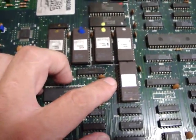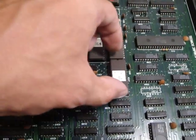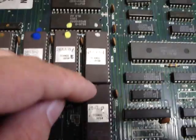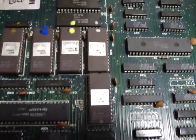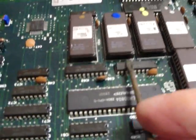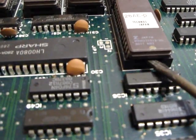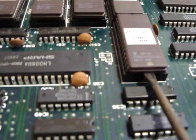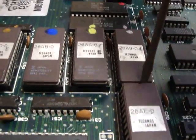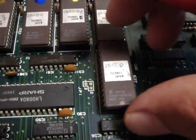What I'm going to show you today is how to remove an EPROM or IC — this basically works for mask ROMs, anything that's socketed — how to clean it up, and how to replace it. There are tweezers you can get that fit around both sides and let you wiggle and pop it out, but on some arcade boards it's really hard to get in between because of the small space. What I recommend is a thin flathead screwdriver. The key part is you don't want to get under the board or cut any of the traces.